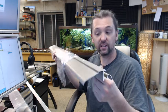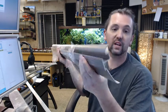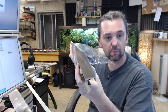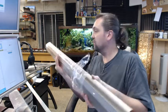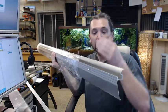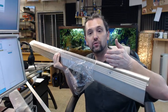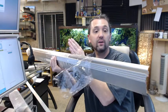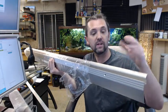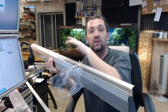Available in several different lengths. If you have need for a custom length, by all means let us know by ordering the next longest piece or pieces and indicate in the comment field what length you'd like for us to cut the material back to. The reasoning is if you had to take this 4-foot threshold and cut it down to 42 inch, you'd probably eliminate that slotted hole that's there, or pardon me, the countersink for the screw. Then the next one is all the way over here. So if you order a custom length, we'll not only cut it down to length, we'll locate that countersink at the proper distance from the edge and the proper center to center as well.